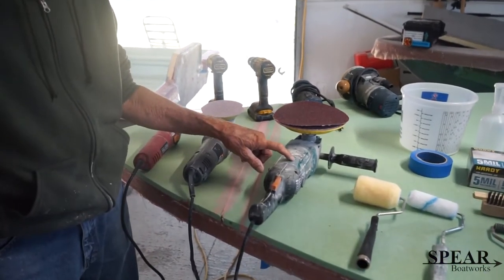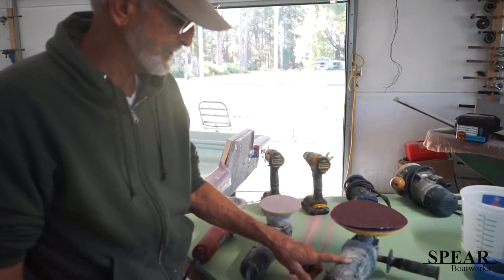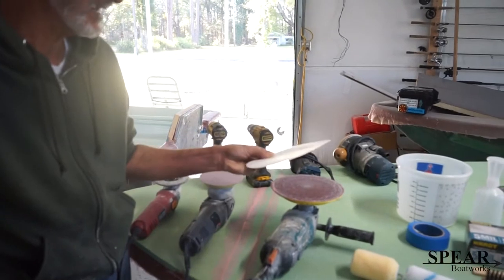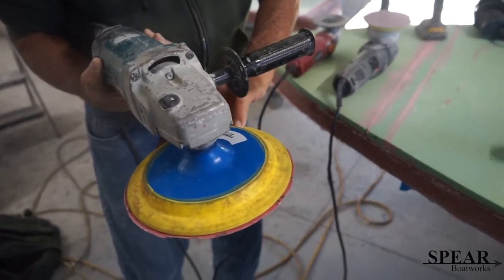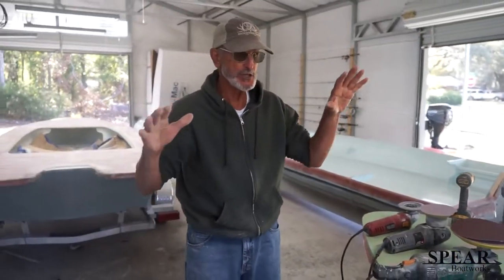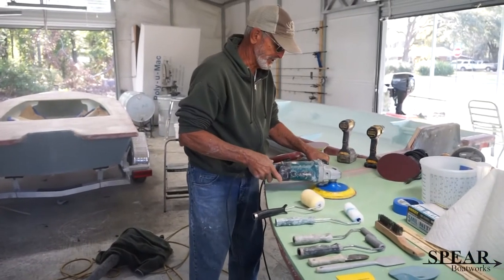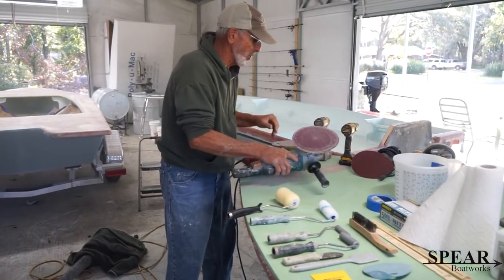This tool right here is my honey. This sander polisher — I run it at about 2,000 RPMs, right on 2, and I use a 36-grit pad on it. These stick-it pads on these 8-inch discs — it's a medium pad, not super soft and not super hard. I use that tool for beginning to fair and to knock things down flat. You want to leave that tool dead flat when you're using it, not pressing really, mostly lifting. You're not pushing hard on it.